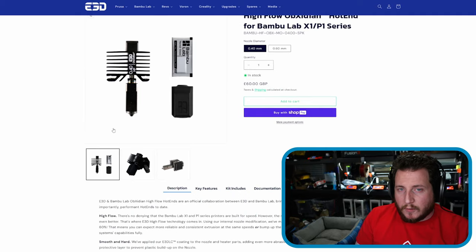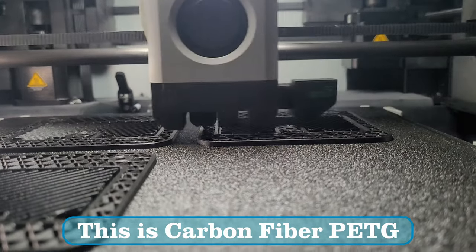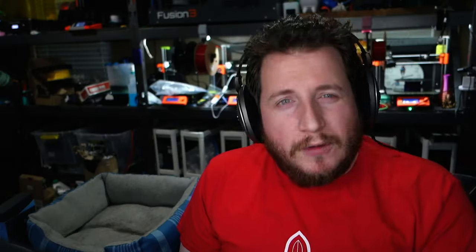I've had minimal issues with this nozzle. One thing to note: at the 0.4mm size, glittery filament — like galaxy-style — can have a tendency to clog it, and clogs in nozzles like this can be a nightmare to clear. If you print a lot of glittery filaments, we'd recommend going up to the 0.6mm to be a little safer. When we toured E3D we got to see how these were made.